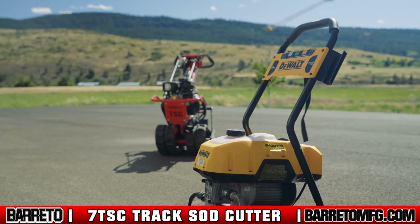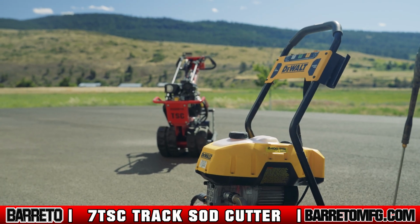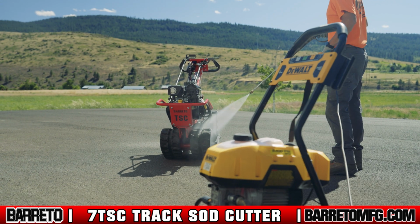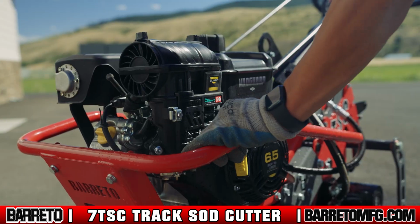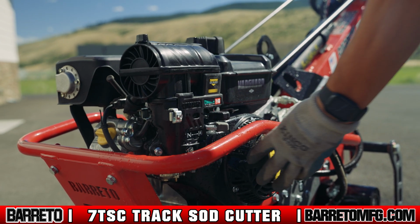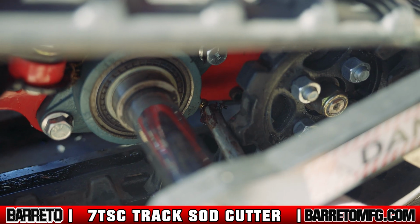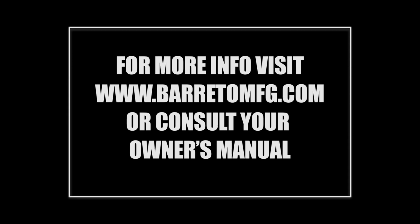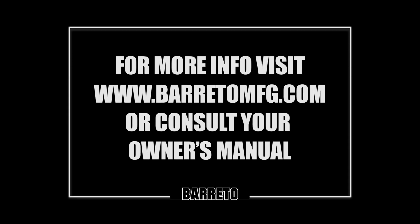Always thoroughly clean and service the sod cutter after every use. To clean the machine, wait until it is cool and then spray it down with water. Once clean, run the machine briefly to remove water from the system. Once you return to the shop, complete all other required cleaning and lubrication. For specifics on these tasks, consult your owner's manual.